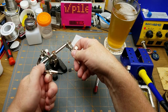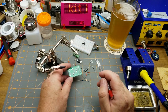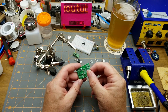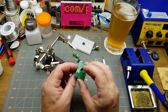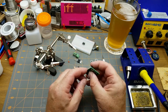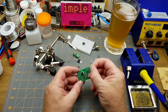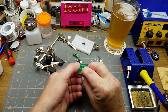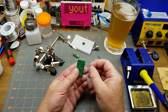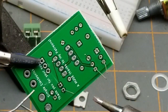Just because it's an old-school circuit I'm going to use the helping hands. Typically I like to go chip last because it's the most fragile thing, even though the 555 isn't that fragile. Let's put the electrolytic in first since it's the biggest. Negative goes up to that side — see the big blob of white on the symbol. I can see the spokes going off to the positive plane. Let's give that a little kink on the back. I'll do all the capacitors at once — just a little bend, not a huge bend.